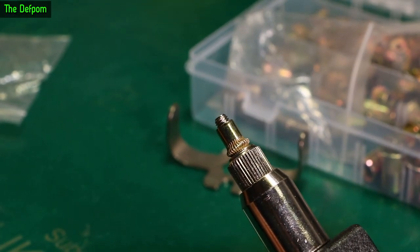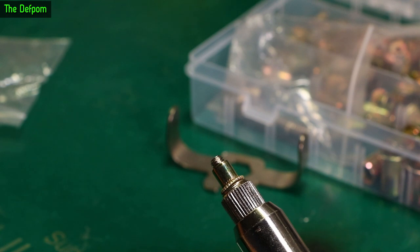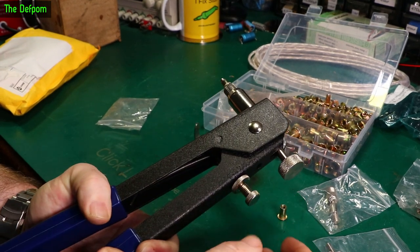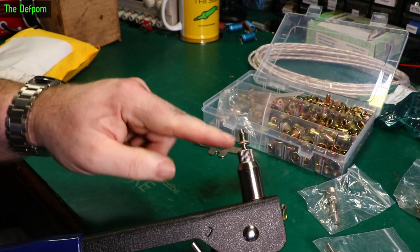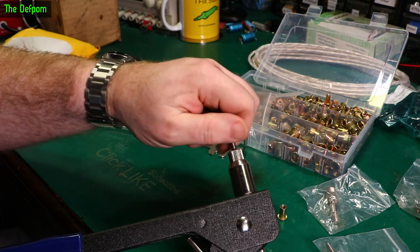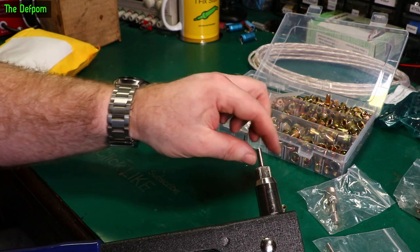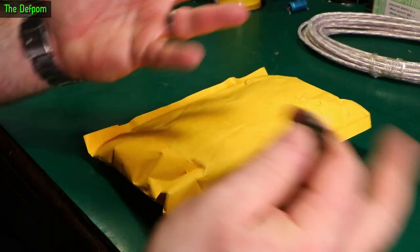So it started going there. See that? That appears to be about it. So I need to adjust this so it's basically going to touch at that point so I don't overdo it. And there you go — that's the rivet done. Obviously you do this on a plate normally, and that sandwiches it. That's fully compressed so happy with that. So I need to go and do this and see if it works. I'll use the rivet nut tool — worked absolutely fine. There'll be a link for that down below.